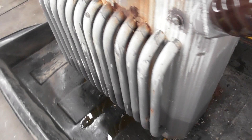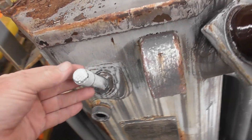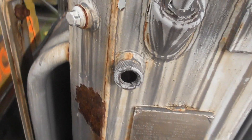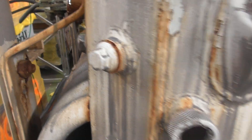I may take the top lid off. This is a bit crusty. The plate here is a dipstick — you don't see that on transformers anymore. You can put a temperature probe in there. There's the oil glass. It's pretty dark.